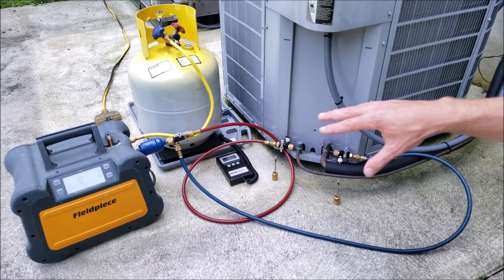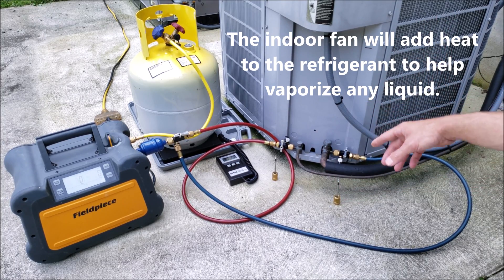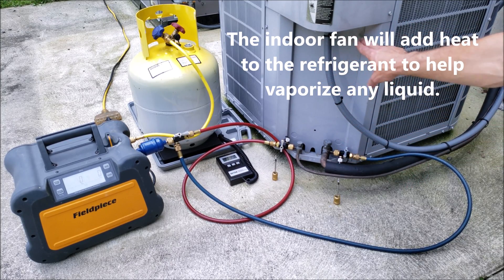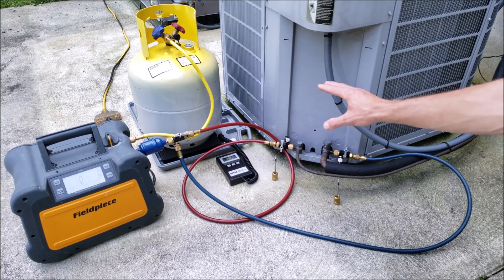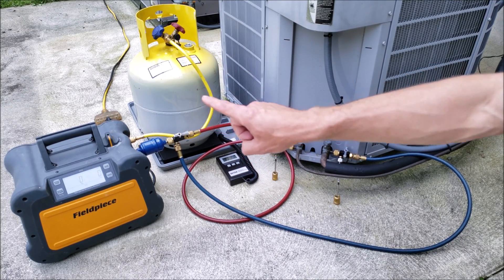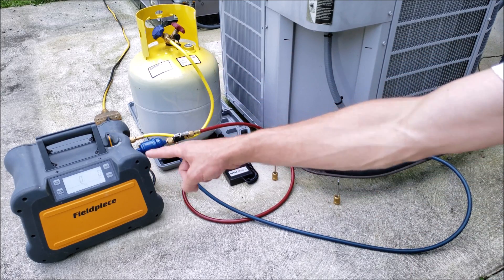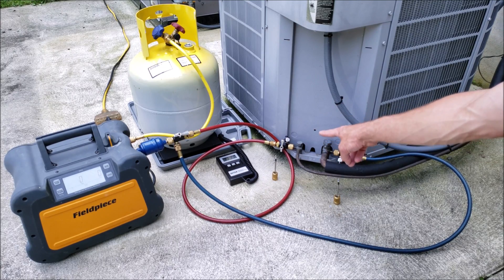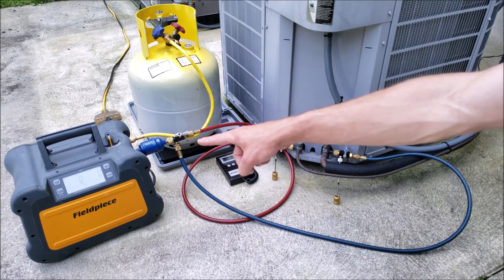We want a fast recovery procedure. When we recover the full amount of refrigerant, we typically turn the indoor fan on and pull the disconnect for the outdoor unit. We want to make sure this unit does not turn on while we're using a recovery machine. You would be pulling saturated refrigerant out of the system into the recovery machine, which pressurizes the refrigerant and pushes it into the recovery tank. The recovery machine reads zero PSIG because we have the valves on the valve core removal tools in the off position presently — they are the only things holding the pressure back.